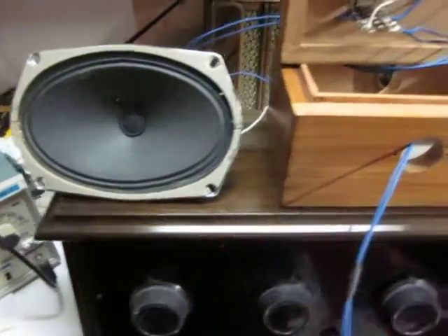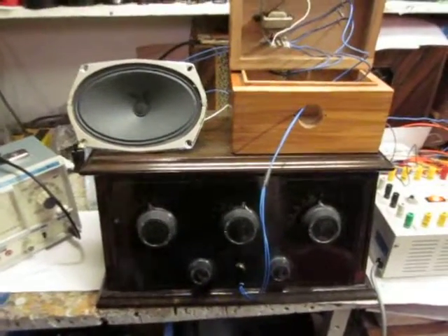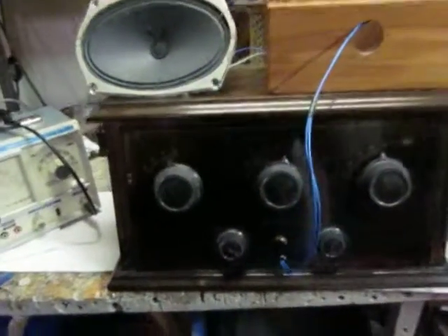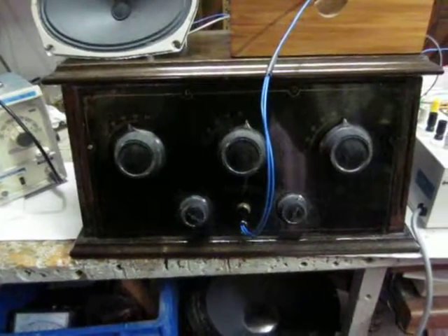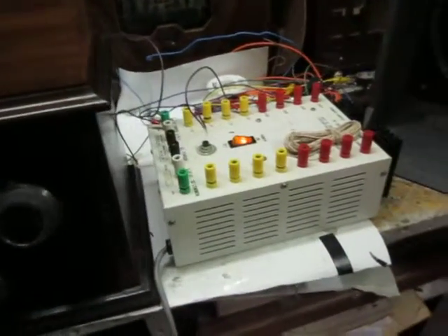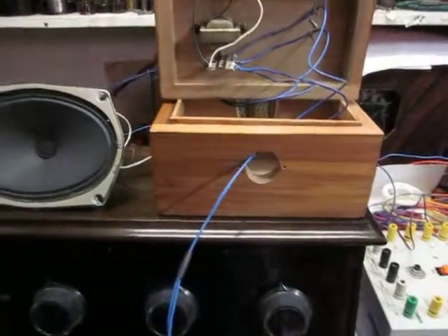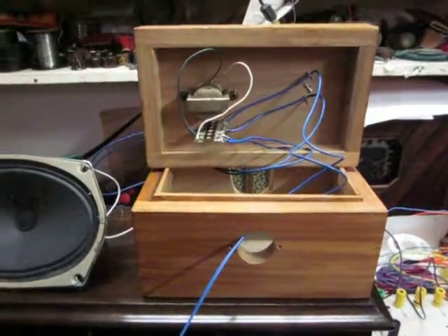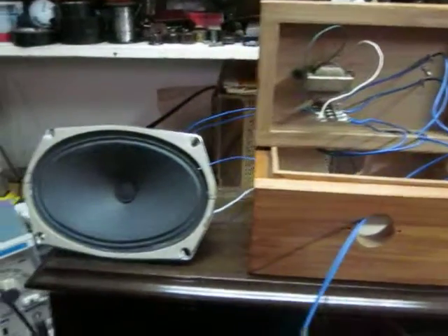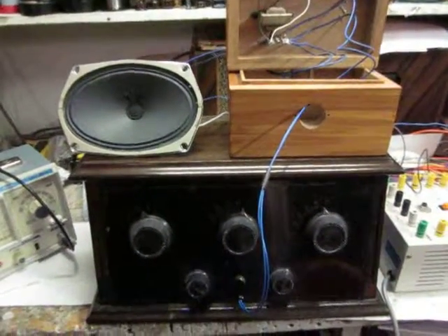Let's turn it up a little bit. Simon and Garfunkel playing. So once again, there's the Aerodyne Special 1925 radio. Runs by tubes, 201As, through a modern power supply which replaces the batteries. Playing through the Magic Box — it's no longer magic since the mystery has been revealed. Just a small output transformer connected to a modern speaker. Ace Eagle saying goodbye for now.